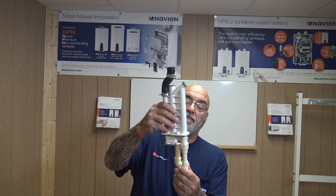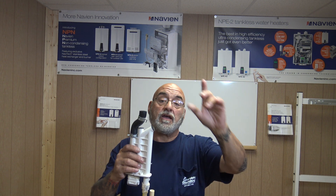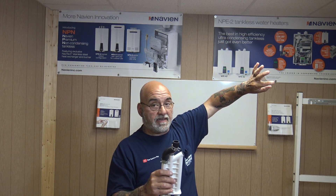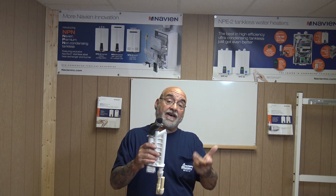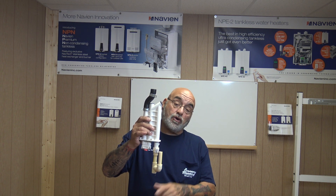With this condensate trap — let me just go over this one. Once you're done with the install and put the little doodad on the bottom, we don't put any pipe in. What you need to do before you put the vent on — so you've got the water pipes done, the gas pipe done, and you've got this done, relief pipe, no vent — take a 12-ounce bottle of water, pour it down the vent of the NPE model. Whether it's an A2 or an S2, it's the same thing. Doesn't matter if it has the pump or not, they both have this. Pour 12 ounces of water down, or until you get a little bit of dribble out of here — you want to prime the trap.